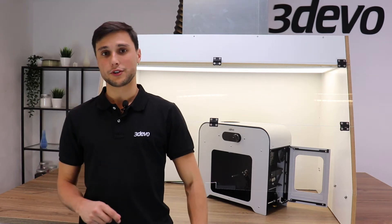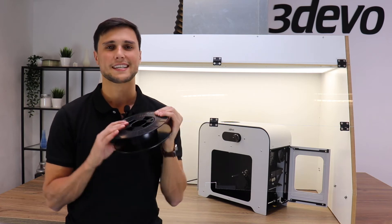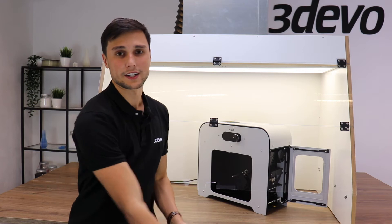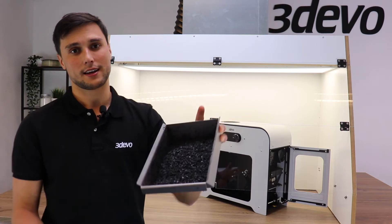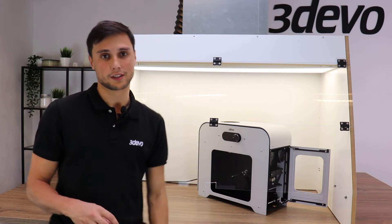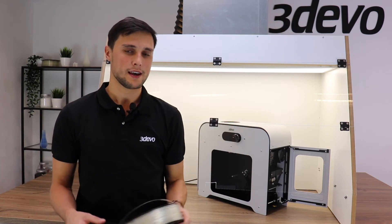For example, choosing a material. We had a lot of these spools lying around, so that's why we chose it, and also because it's a nice and tough material. So the first step was to actually shred this into smaller pieces and we obtained what we call regrind. Then we have to make some 3D printing filament, which looks like this — it's basically a plastic wire which feeds into the 3D printer and serves more or less like the cartridge for it.